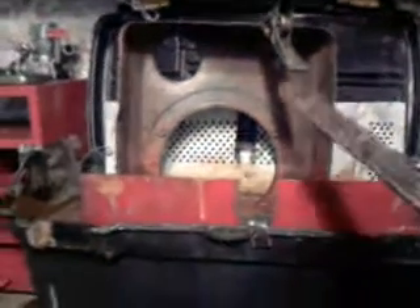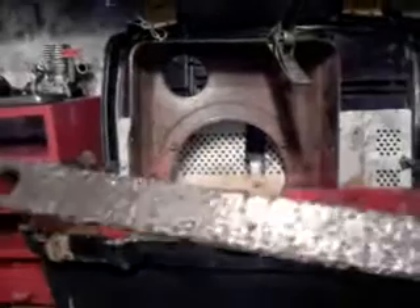I'll show you what actually happens to these plates over time. When the sacrificial anodes need to be cleaned, what you do is you hang something else in the tank which you don't really care about and you swap the polarity of the wires. These here are always live and your work piece is always neutral if you want to strip something. But when you need to clean these, you put something else in there and you run the polarity the other way, and whatever's in the middle becomes your sacrificial anode and these become your cathodes - it will actually clean these for you. But this is what happens to your metal - it has been completely eaten away. It's just pitting in the metal.